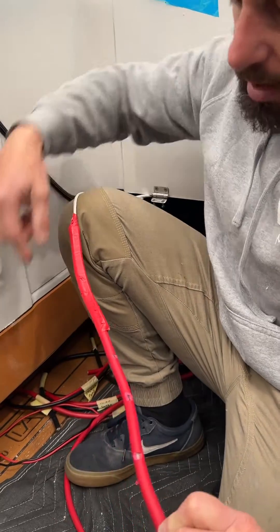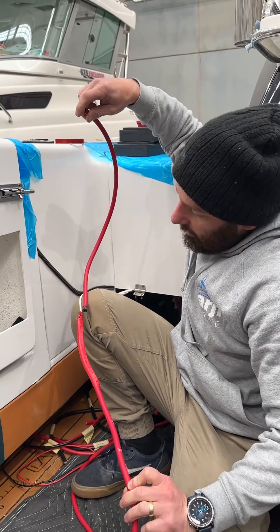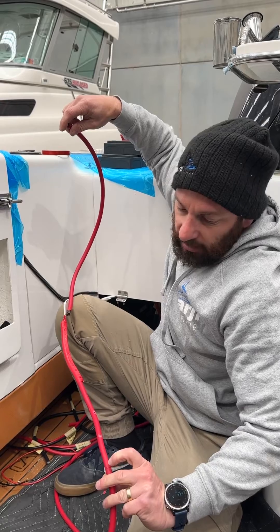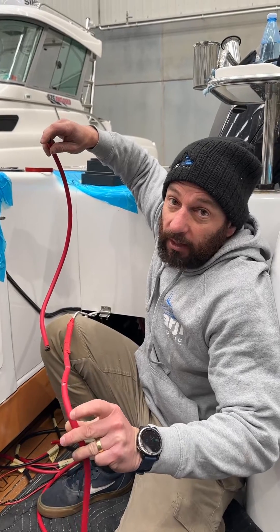So we've gone back well over a metre from where the battery switch was and where the corrosion was seeping in. You can see that salt, over — this boat's about five years old — has travelled more than a metre down this 25 mil battery cable. This is the main cranking cable and obviously the charge cable coming out of the alternator on that Mercury.